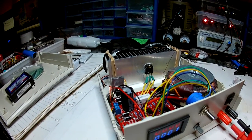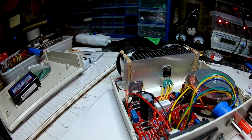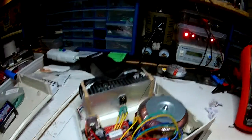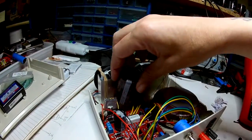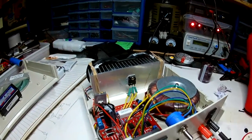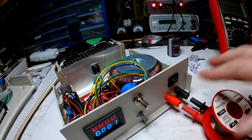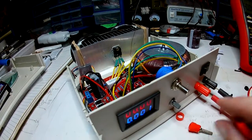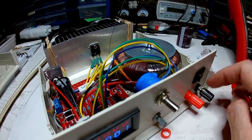Linear regulators need some capacitance on the input to stop input ripple. I've got some 10-millifarad capacitors - another bunch of them came through today, very nice - but they're probably not going to fit in there too well. I'm not even sure they're going to be needed, we'll have to see what happens. I've also got these output binding posts - the problem with the other ones was you couldn't unscrew them and wrap a wire around, but on these you can unscrew them nicely and wrap a wire around, and they've actually got holes through them.